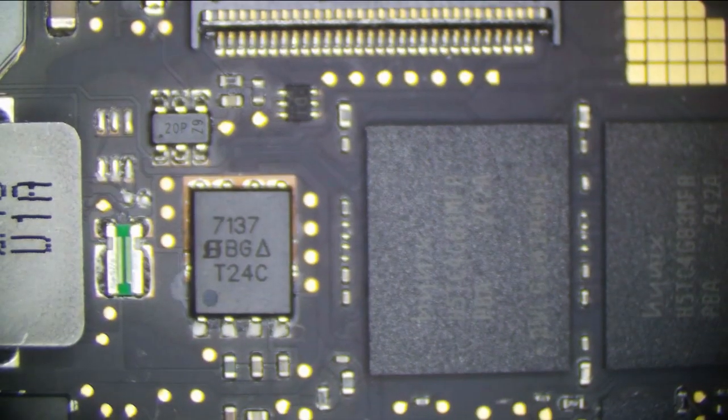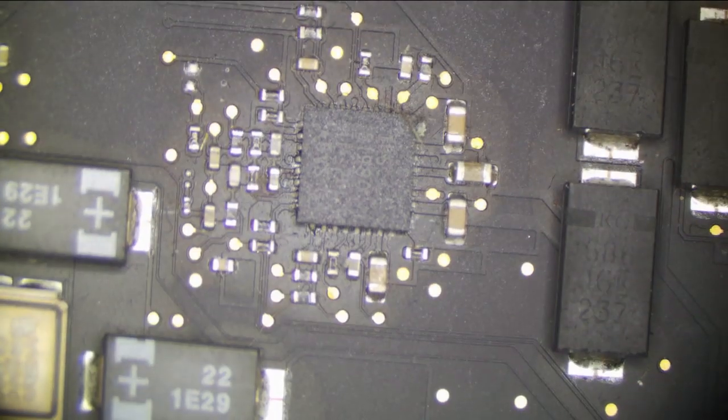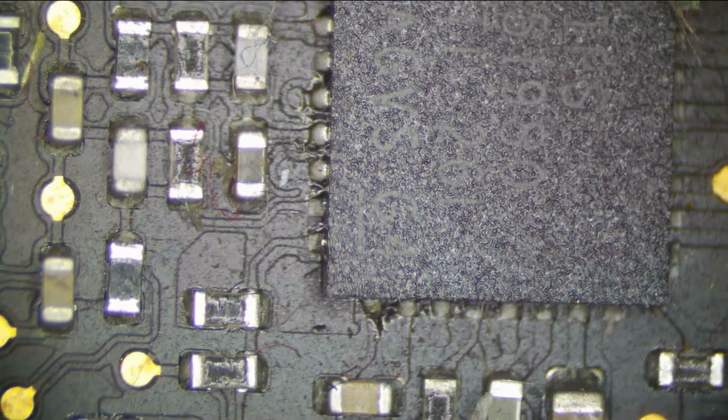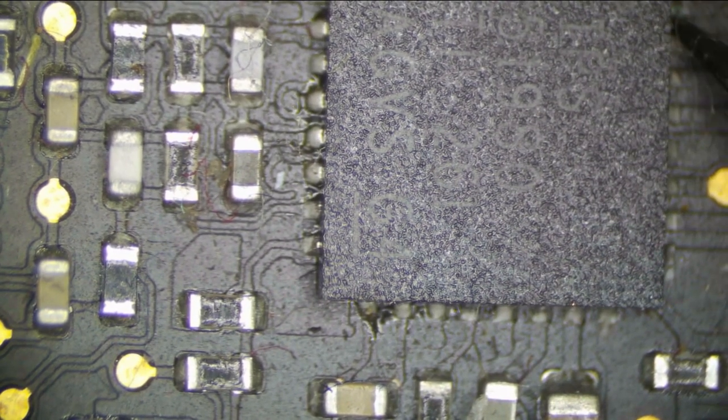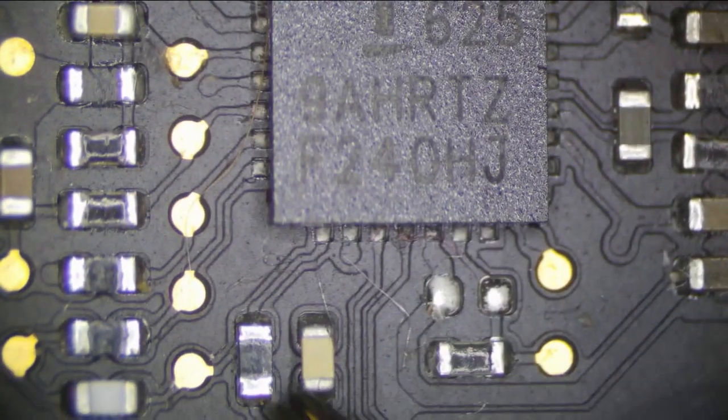Let's look at our ISL. The first area I suspect is an issue around our ISL. Notice somebody looks like they might have replaced the backlight fuse at one time — that's not really relevant right now. Here is our 3.3 volt and 5 volt rail regulator, the TPS51980. There's a little bit of corrosion there; I don't think that's going to do anything though. The ISL looks totally fine, the current sensing resistors look okay, no holes in them, nothing that suggests an issue.